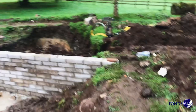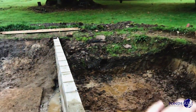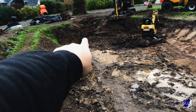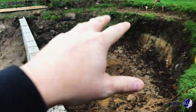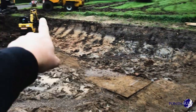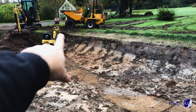If not by the end of today, by the end of Monday it's going to be ready for liner. And then we'll line it from there right the way through, up and over and back up. We'll put some aqua crates in, put different-sized rock and gravels all the way up to the top. This section will also have gravel. The pump's going to go down there, come up the bank, come down here underneath the gravel all the way across. The actual inlet of the filter bay will be right at the bottom so the water has to flow up through, and you'll have all the beneficial bacteria. All this will be planted — the whole area will be planted and the plants will continue down the side. And then this is going to be our diving board. We've got a pontoon going up, so I need to put some wooden legs coming up, and then they're going to put a decking area there. It's going to look amazing once it's done.